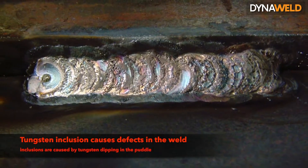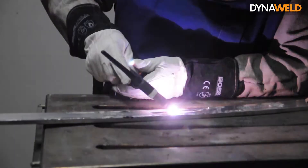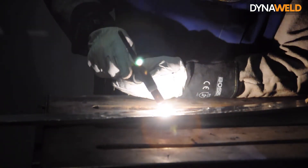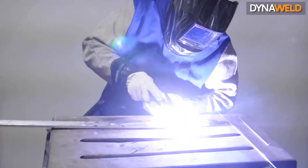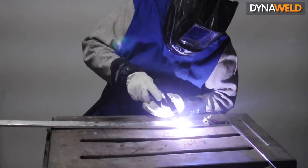This risk can be minimized using the lift arc technique, where the short circuit is formed at a very low current level. The most common way of starting a TIG arc is to use HF, high frequency. HF consists of high voltage sparks of several thousand volts which last for a few microseconds. The HF spark will cause the electrode and the workpiece gap to break down or ionize, and once the electron or ion cloud is formed, current can flow from the power source.